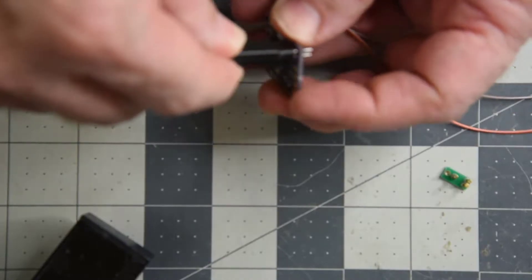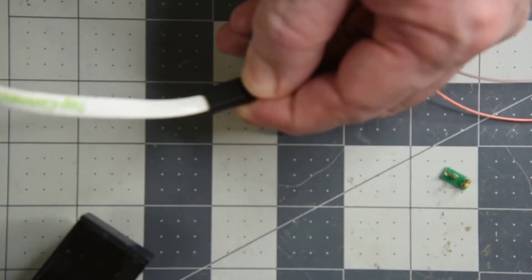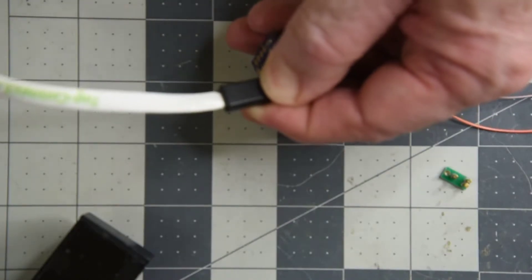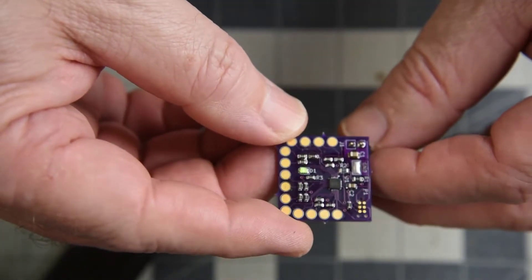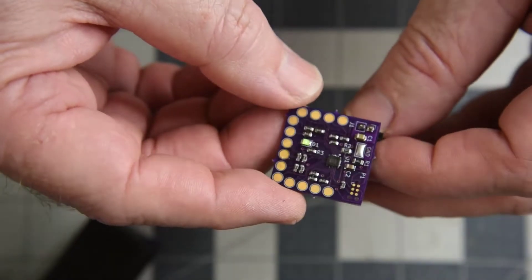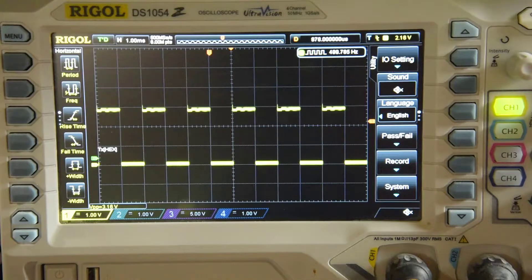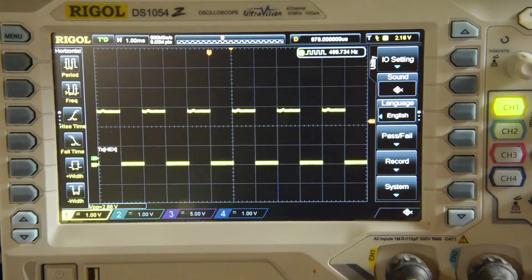I'll run some power to the board and then see if the PIC will program. This 20 pin PIC has 2 power pins, 3 pins for programming, 1 pin to the LED, and 14 pins go to test pads. The program toggles the pins to the LED and the 14 test pads every 1 millisecond. I put a 430 ohm load resistor on each of the 14 test pad pins, so as long as the signal looks like this on a pad, I'm satisfied the pin is properly connected.